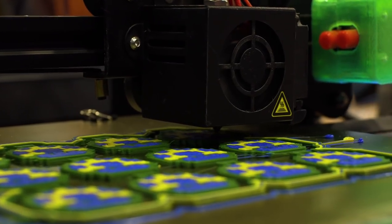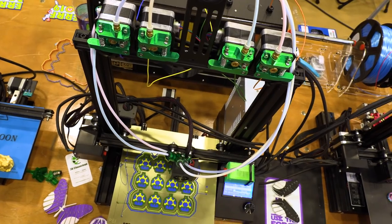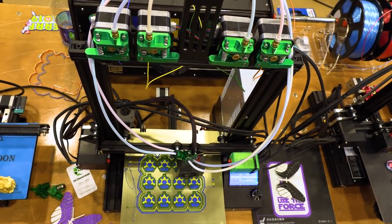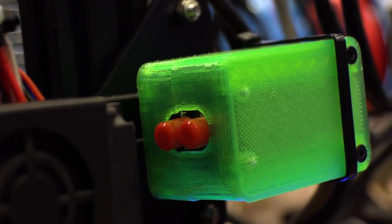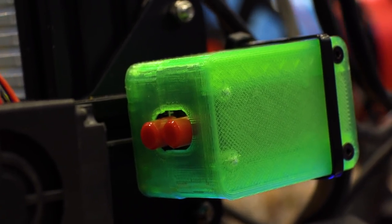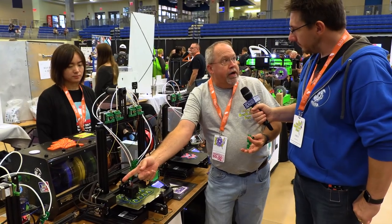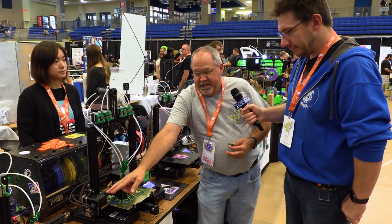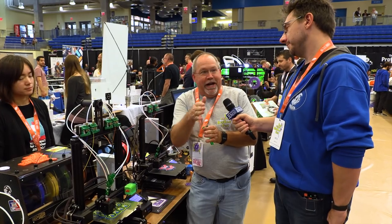That little piece houses a lot of magic. If you look at the setup here, that one magical piece is just part of this amazing system. You have four steppers up top, and you've got these switches right here. Literally mechanical switches. So it's a binary tree — we have one motor cable coming in from the extruder. It gets split into left or right, and each one of those gets split into our left or right switch. So it's literally a binary tree.